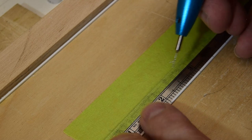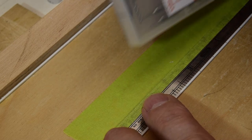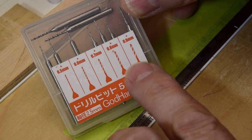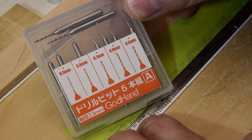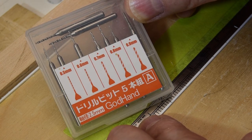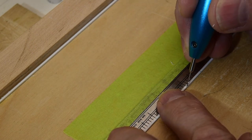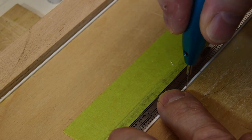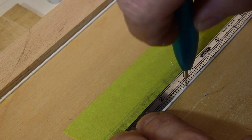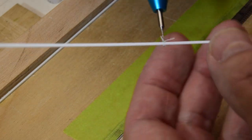And then I take this drill, which is around 20 thou, one of these drills here. I don't normally pay attention to the numbers. I just eyeball the drill bit, try a test piece first, and then slide the rod in and see if it fits. You don't need to do any math, really. Then you can see where they're marked, and I position myself, probably more convenient than this with the camera, and I just hold it upright and let the weight of my hand do the work. I don't push down, I just twist the drill like that, see?